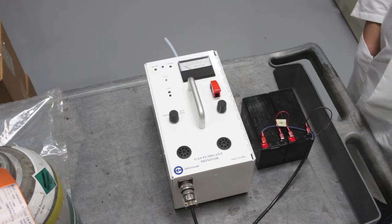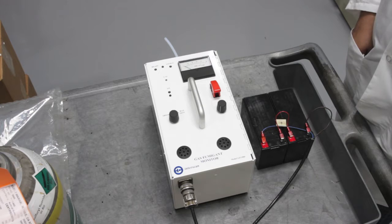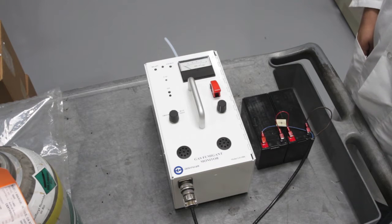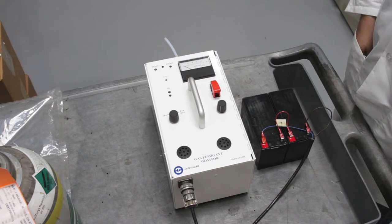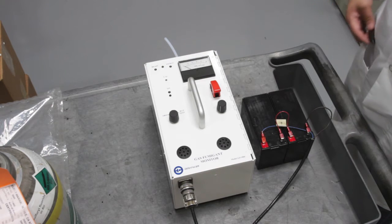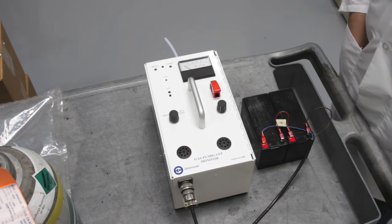The sulfuryl fluoride monitor's sensor must be stable for readings to be correct. Prolonged non-use causes the sensor to be unstable. The sensor must be exposed to an internal bias voltage periodically. If the analyzer has not been used in a duration of 2 weeks or longer, you must power on the monitor and allow it to stabilize. A stable reading may take up to 3 minutes to achieve.